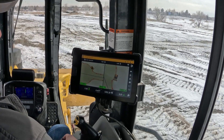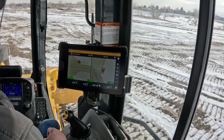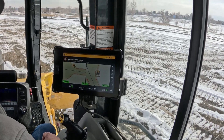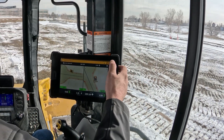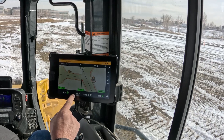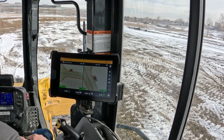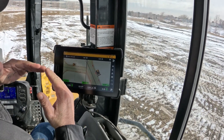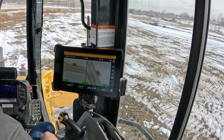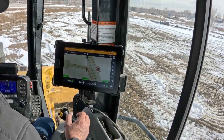These need to be nice curved lines in order for it to follow properly — I'll show you in another video. The steering system error is warning me that it's off just a little bit. But you can see as I come around the corner it still makes the correction; it was off just a hair. You can manually take over. If it's got a 90-degree or any sort of a point bend to it, it's going to automatically come off that line. So you can see we went around the outside of this line.